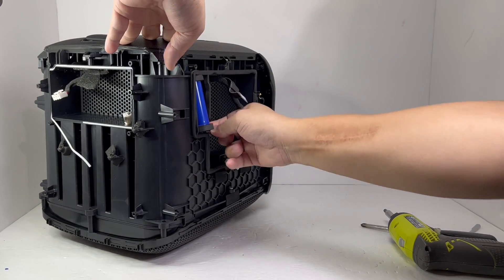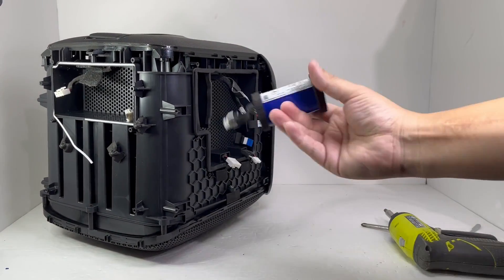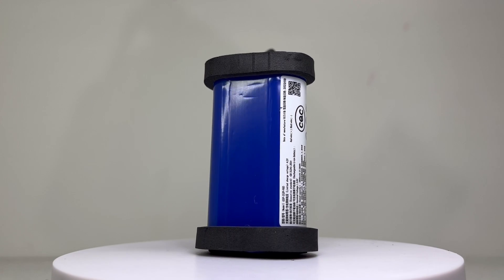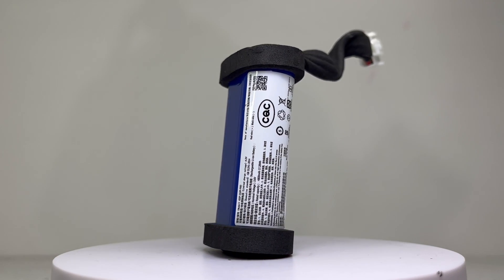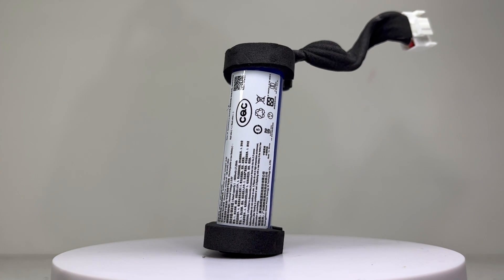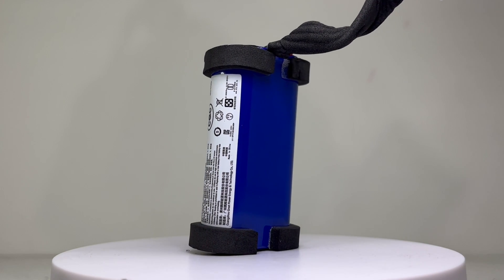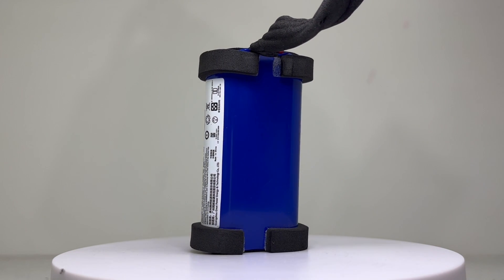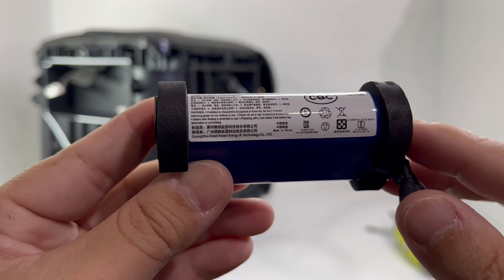Now let's remove the battery. I was quite surprised by how small the battery the Encore contains. It has a 4800mAh battery pack with a charge time of 3.5 hours and a playtime of 6 hours. With my everyday use of the speaker, the most I've gotten was around 4 hours of battery life. You can easily double the playtime if you add another battery pack in parallel to the existing one and tuck it inside the speaker, as it has plenty of space available.